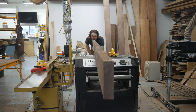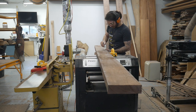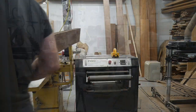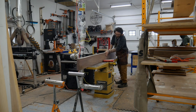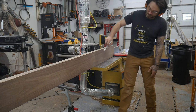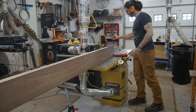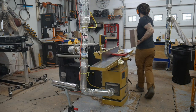I'm just eyeballing these to figure out which side is gonna take the least amount of work to get flat. Now the fun part begins — wrestling all this heavy lumber just to get two straight edges. We're just gonna run this through the joiner a bunch of times to get one straight edge and one straight face and then mill the rest down to get it square. We actually had to move all of our tools around a little bit just to get that extra room, as they don't really work with stuff typically this long.